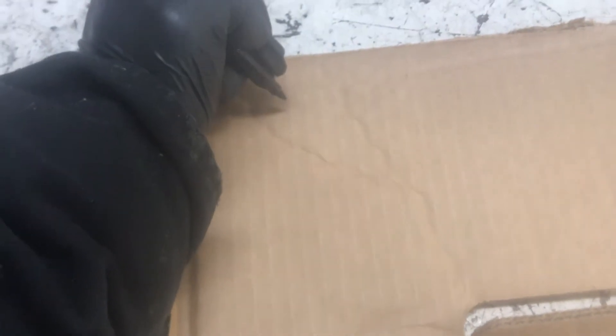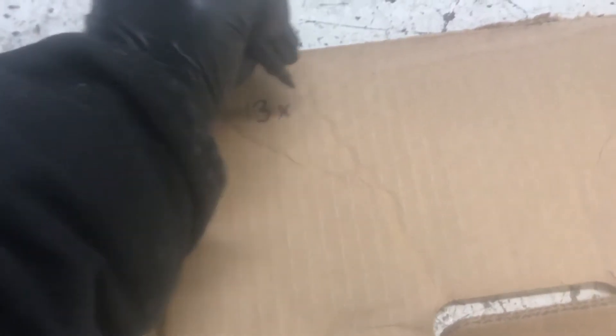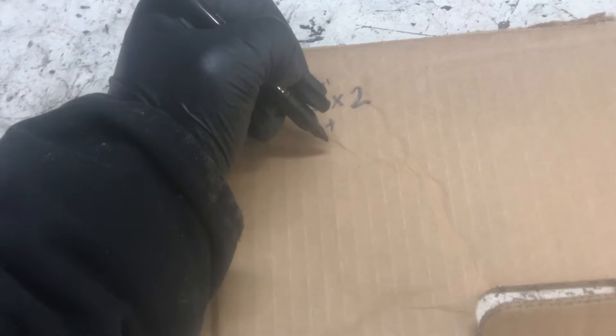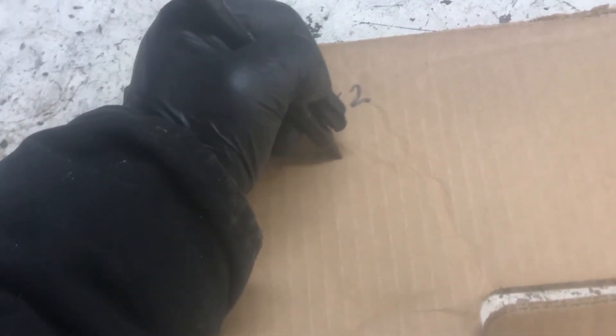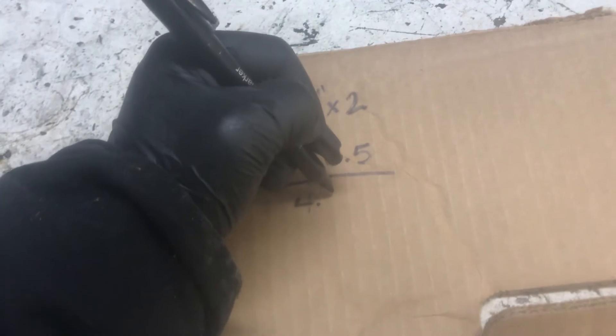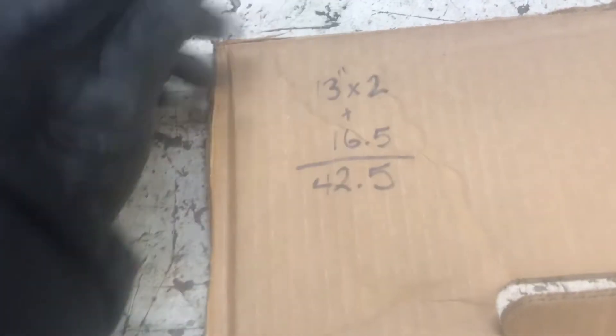Give it a little room for inaccuracies. So, 16.5 inches by 13 inches. We have two sides at 13 inches plus the length of the condenser coil at 16.5 inches. Add them up and we get 42.5 inches — that is the total length we need for our shroud.